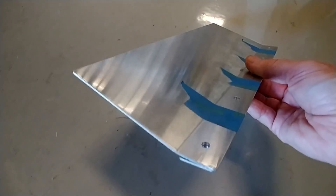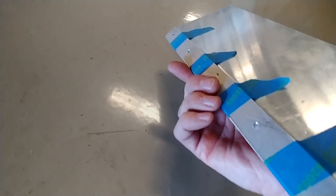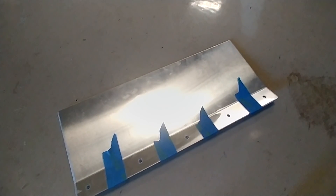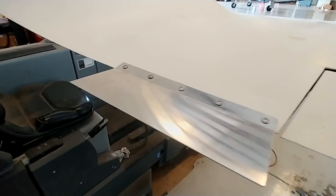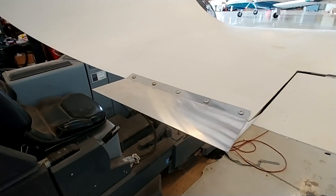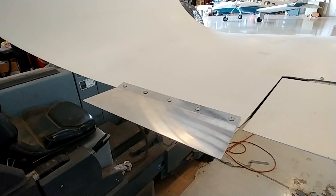You may recall that on the first flight I still had to put in some aileron trim — the right wing was heavy even though the aircraft was balanced by weight. I'm under the impression there's still something causing it to want to roll to the right, either torque from the engine or something aerodynamic. I've checked the wings and don't see a problem, but it could be the winglets. So I'm putting together a tab — 12 inches wide and about 4 inches deep, set to 20 degrees right now. Instead of having to always have the aileron trimmed out, this will put a downward force on that left wing. This is quite common on aircraft to balance out any imbalance.